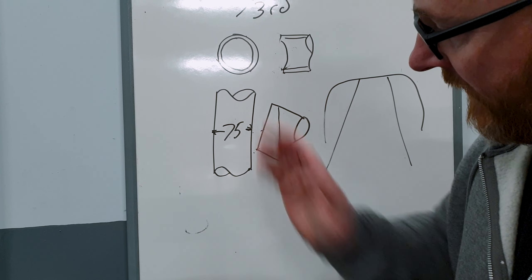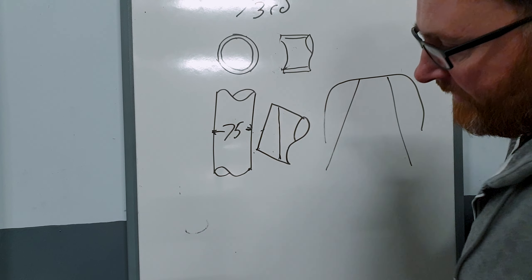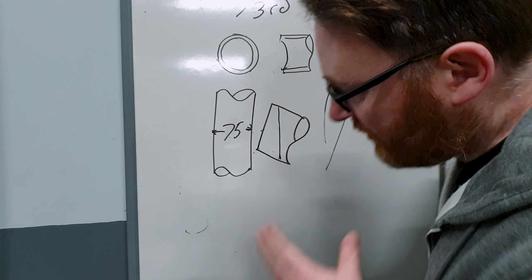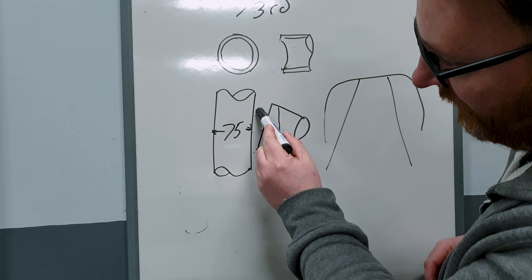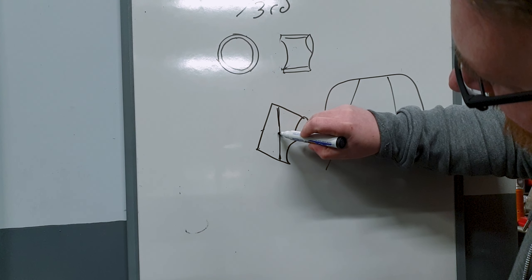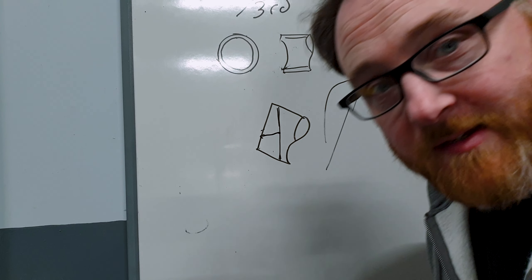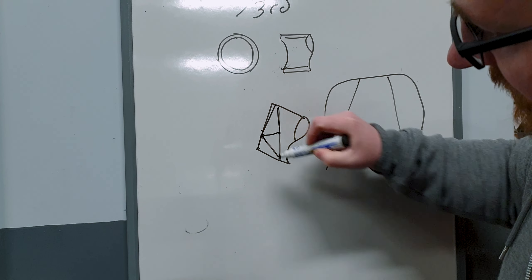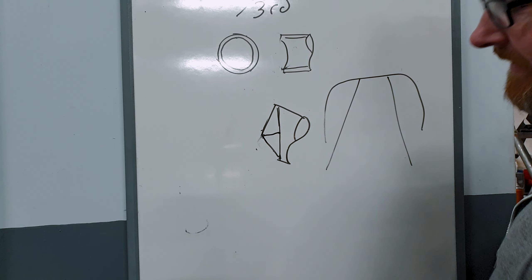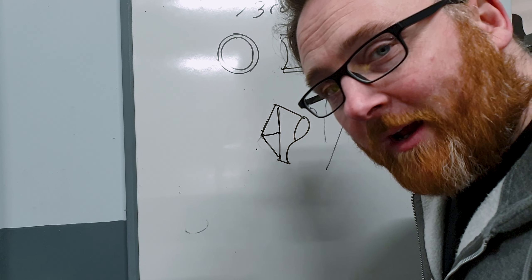Here's an example of what we're going to want to do if it's an angle. I'm looking for approximately 15 degrees — I've not even measured it yet. We're going to need a similar cut along that profile. How do we know what that is? I'm going to take the excess tube, put it behind here, and just use this angle from this pipe to scroll onto that pipe — that line, that's it. Once we've got that line and know exactly the angle we need, I'll find the centre. Using the same logic of a third, measuring in 25mm to here and projecting the same lines again — 25 up to there, and 25 down to there. All of a sudden I'm left with a very decent profile that will, once dressed down a bit, fit the pipe. At least that's the theory — let's give it a go.